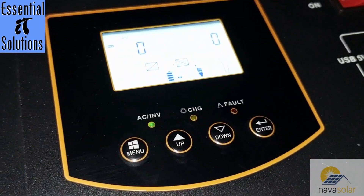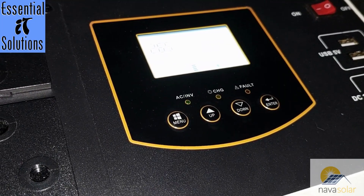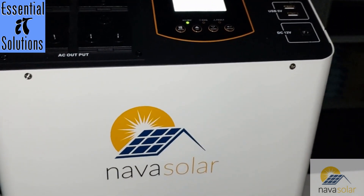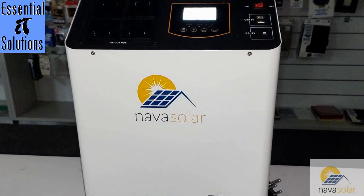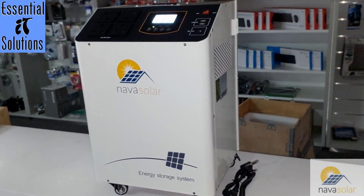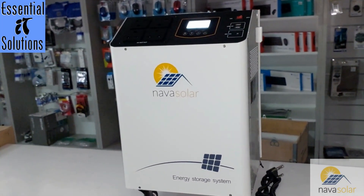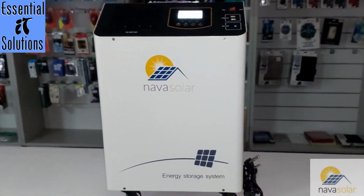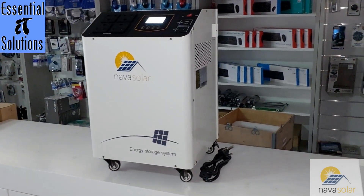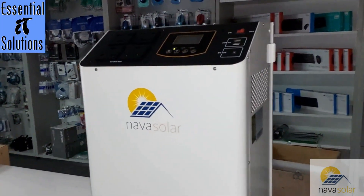The fans have now stopped — the unit is fully working. While discharging without load, the fans stay quiet; they only spin up when you put load on and the inverter warms up. On the battery side, the 2.56kWh battery gives you about 2048W of usable capacity. At a 500W load you'd get through a four-hour load shedding session. The 3kW pure sine wave inverter can handle a double-door fridge at around 300W, a TV from 80W up to 150W depending on size, a DStv decoder, a WiFi router, and a fiber ONT.